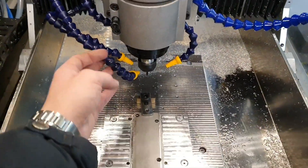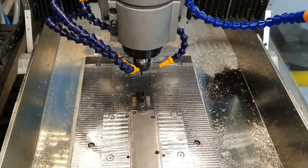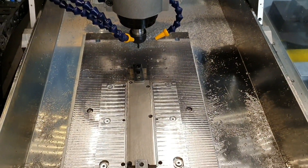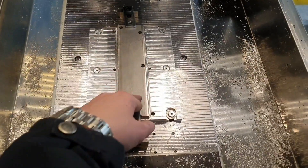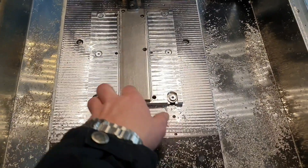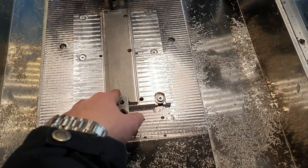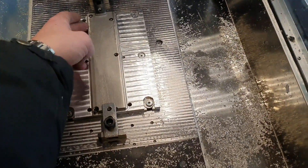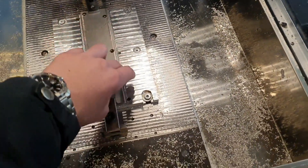I've now mounted three coolant nozzles here, so hopefully that will reduce the coolant flying around. I thought I would start out with just milling the contour at a very low depth, just to see that I won't hit the holes or anything like that. These holes I made since I needed to have free access around the part when I milled it.